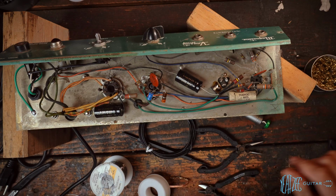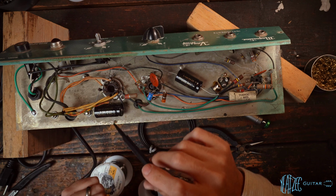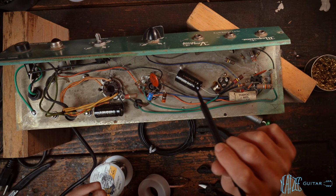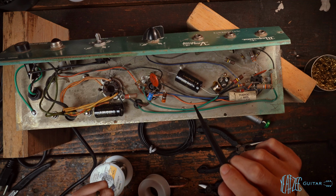That worked out pretty well. We got the other filter cap all installed, again using the ground point on the tube sockets, like you kind of have to in an amp like this. They are both siliconed down, rock solid. That's solid. So now we can turn it on and test it.